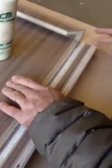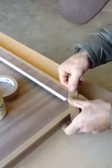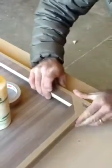This is a good chance to see that clamping tape that lived underneath the sheet while it was machining. As he folds this back up, that long piece of tape — it's imperative that you have that under there. This whole system doesn't work unless you use that clamping tape underneath the joint, because without it, it wouldn't put up with the folding; it would just fall apart. He's just got the one end at the other end to deal with.